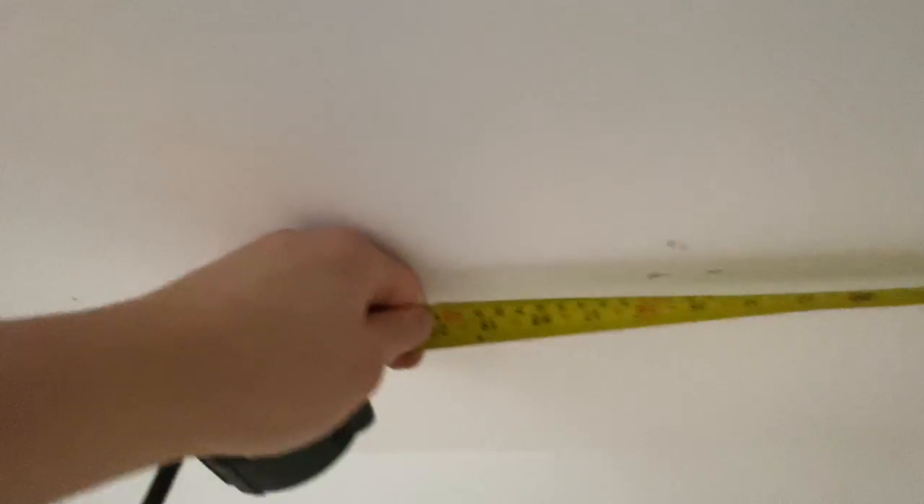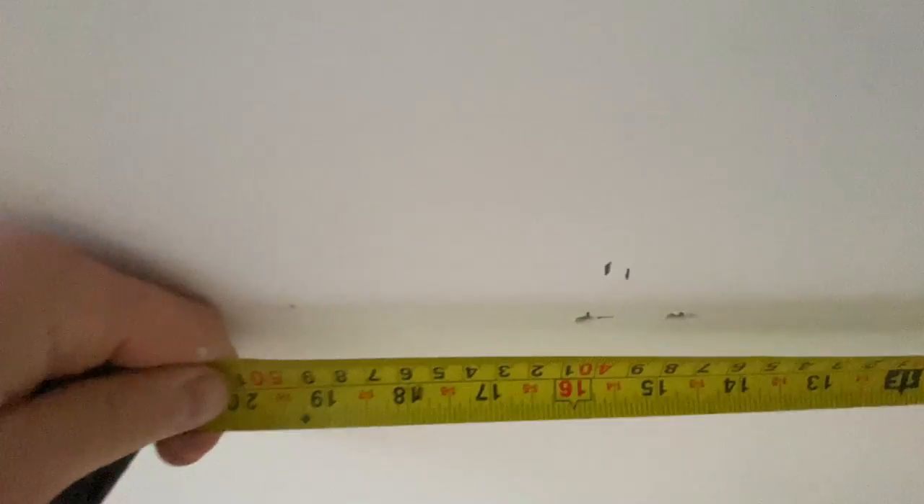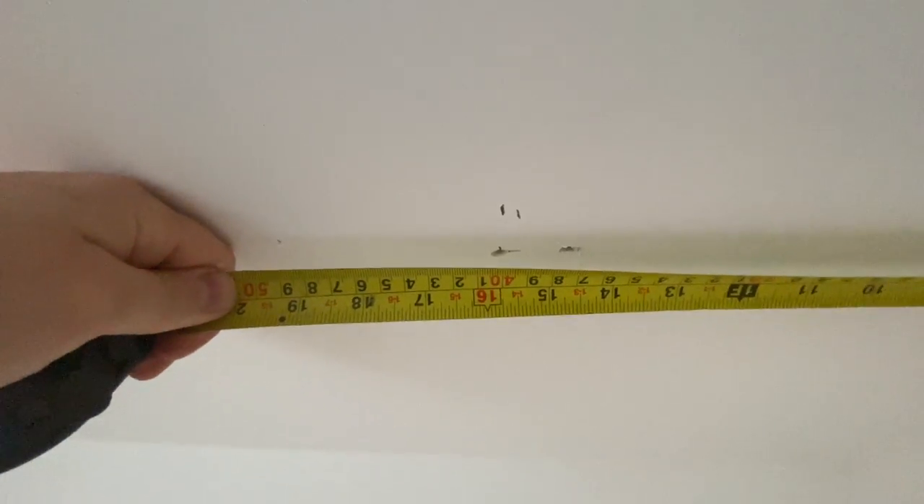We've measured our lights - it's very exciting, I know, but people like this. We've got a timber there and we're trying to match the light. We went 400 but there are some pipes above, so I've come across a couple of centimetres - that's going to be our first light. Then we're going to replicate it. We've got 400 centres here with a timber there and a timber there, so we've come across a little bit and we've got about 25mm gap from the timber. The lights will go there and there. We've only got to find holes through one or two timbers, but bearing in mind we've got pipes there, James - don't be drilling anything. Then we've got to get cable from here to wire both lights.